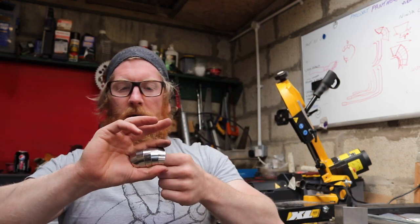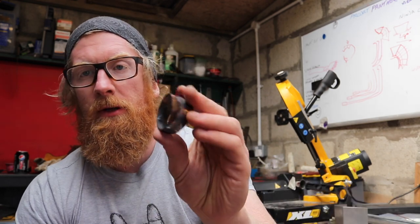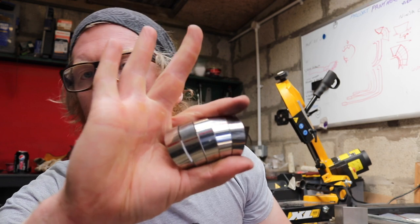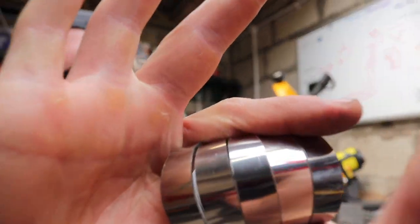Okay, we've cut our first few pie cuts. They are the very first two I've tried welding together. We'll cover that shortly, but they weren't as accurate as they could be, because of the inaccuracies with the Sharpie marking I put on my machine, which meant you had a millimeter and a half either way if you weren't on top of it. So when you start to try and line them up, like so, where you should have a red band, I don't know if you can actually see that, they weren't lining up properly.